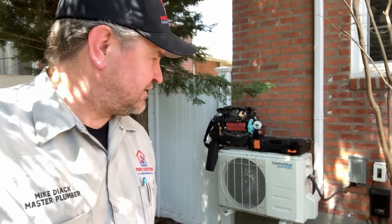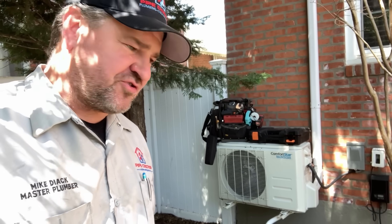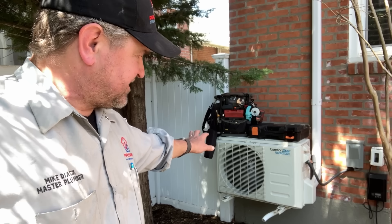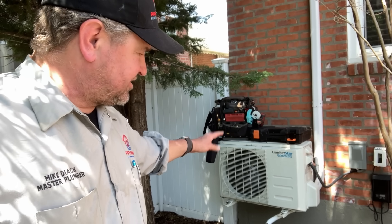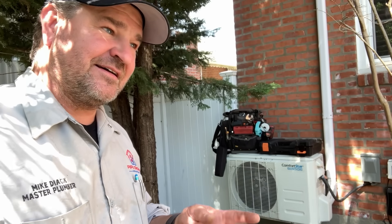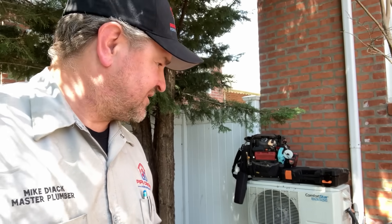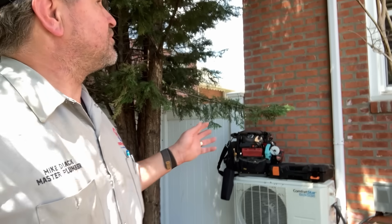I know I'm going to get a lot of slack for posting this video, but I have an existing residential client. We've been servicing this ductless mini split system for about two and a half years and it's slowly adding up. Every year we have to add a pound and a half of refrigerant to the system. They don't want to spend the money to replace it or fix it — they just want to gas and go, and today we're going to do that again.